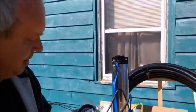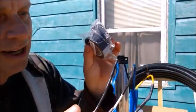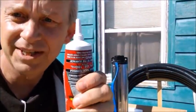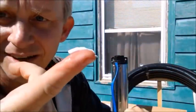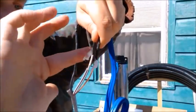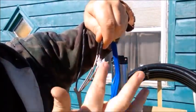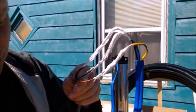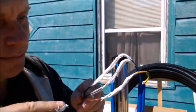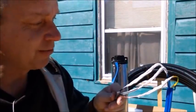The pump came with waterproof tape and electrical tape. I'm going to seal this up with Flex Seal, then use the waterproof tape and wrap it around each one real good, then seal it up again, put some electrical tape, and just keep going through it in layers. I'll put the Flex Seal glue right on my finger and seal up the edges of the shrink sleeve. I've got all three wires sealed with Flex Glue. I'll let this dry about 10 minutes, then put electrical tape over it, then waterproof tape over that, then seal it up again and test it in the water after it dries.